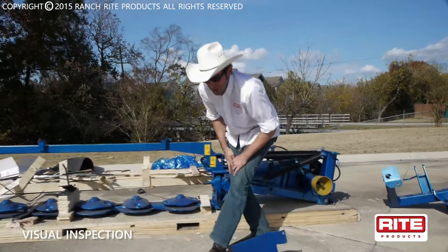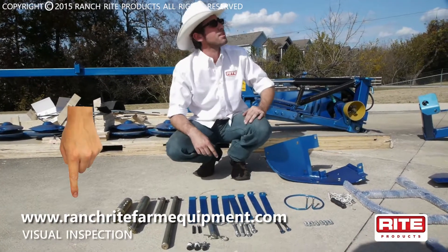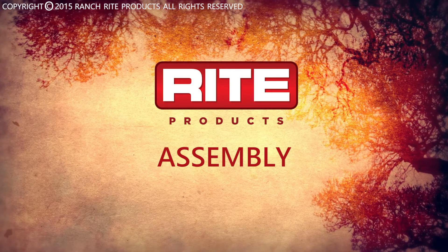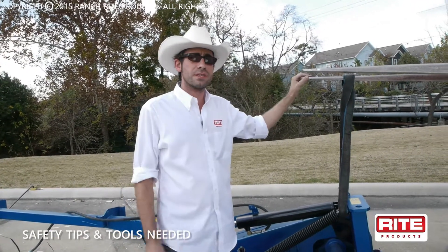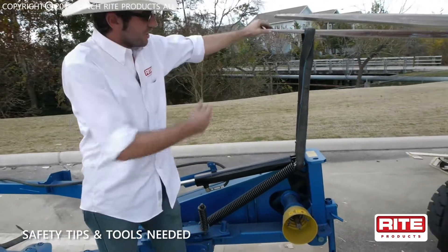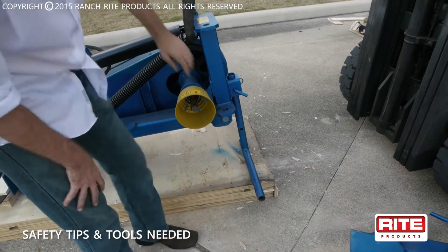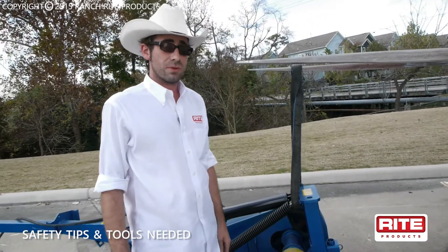We also send a box of parts supplied as shown here. If you're looking for a parts list, you should find one somewhere on this video. Remember to always use proper lifting techniques and the proper rigging when supporting this machine. Always have an operator sitting in the seat when you're using any type of lifting device, because if it's made by man, it can fail. Here we've got our machine supported by a strap. We're going to use our stand today as the original factory-supplied kickstand for when the machine's in the stored position. The stand is pinned off in the stored position with the leg kicked out, to support the weight of the machine as we add parts so it doesn't fall on us during assembly. Remember, safety first.